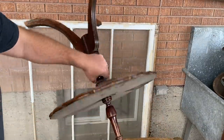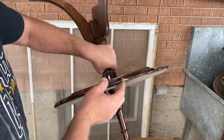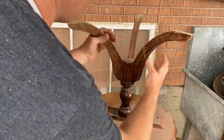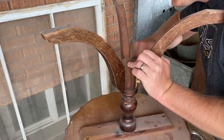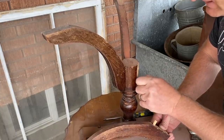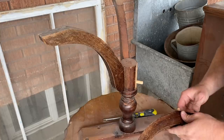This little table here doesn't need a ton of repair. It's got a split, but someone's already put wood filler in there for me, so I'm just going to sand that. It also has some wobble on the legs — the doweling is loose. What I'll do is pry that open and re-glue these and push them back together. The dowel stayed in on both sides, so we're just going to glue the opposite sides.